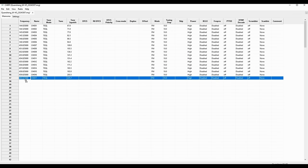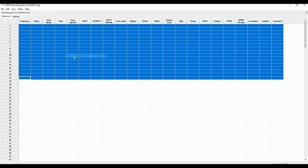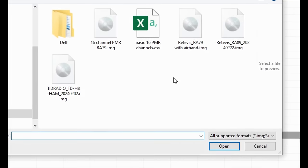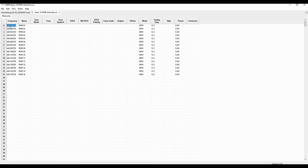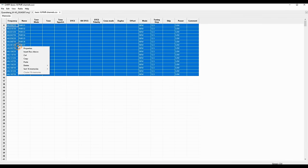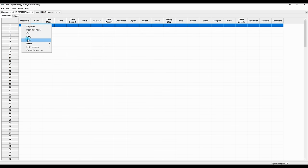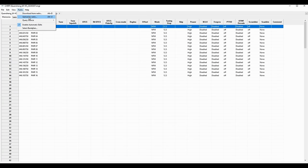I want to delete these now as we don't need any of them on the radio. Simply select all, then right-click and delete from memories. Now we need to add the PMR 16 channels. I've already saved this on a separate file on my computer so I can just open it up - I did go through where you can get all of these frequencies on the full video. These are the 16 PMR frequencies; just checking they're all on 12.5 kHz step rate because that's what we need for analogue. We copy this and paste it back into the Quansheng file.